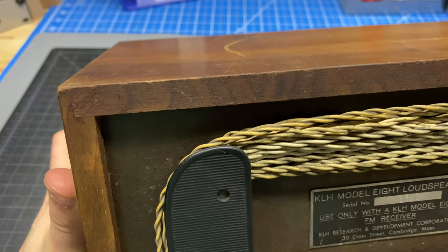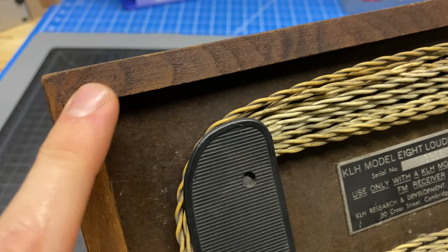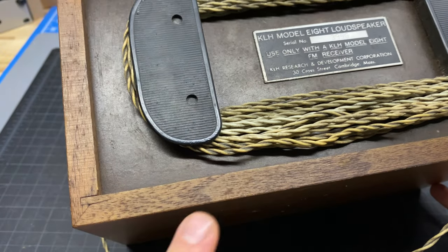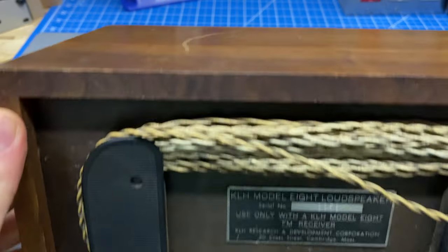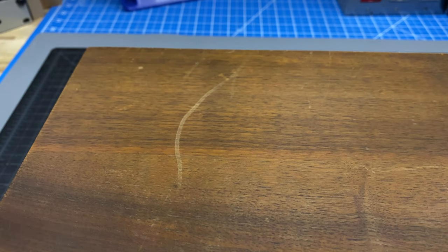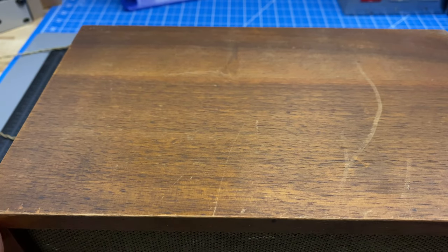There are a couple different types of these cabinets out there. I've only dealt with the solid walnut ones so far. If we look at the back and the joinery here, we can tell this is made out of solid wood. If this was veneer, we'd be seeing plywood and a veneer edge. So this is completely fine to sand all the way through the blemishes. With veneer, if you had a scratch this deep and tried to sand through it, the chances of a positive result are pretty small. But because this is solid, we can sand right through and get down to a really nice-looking raw wood finish.